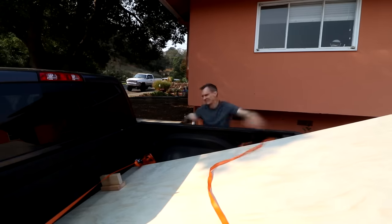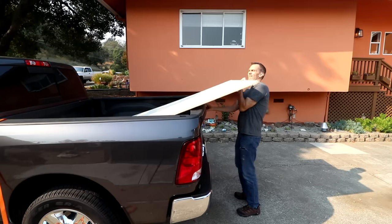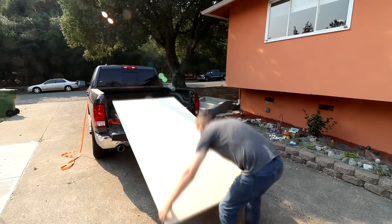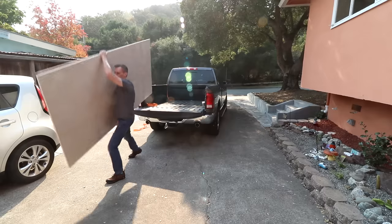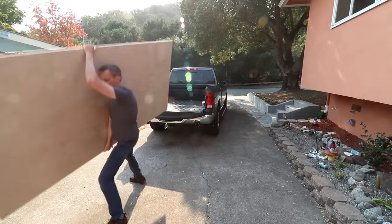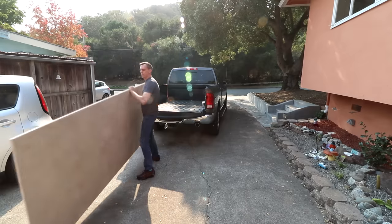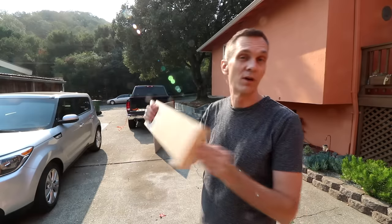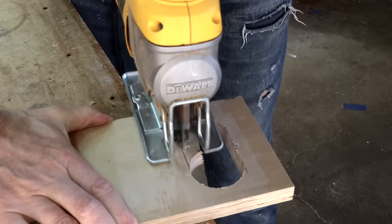The trickiest part about maneuvering sheet goods is getting in position vertically and trying not to damage the corners too much. I've got a fairly long wingspan and usually just reach with my left hand on top and my right hand underneath as a hook. Then I set it down gently, trying not to damage the wood or smash my toes. You can also make a simple hook carrier like this one to help you carry sheet goods. There's a link in the description for a measured drawing.